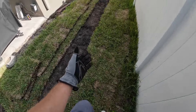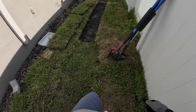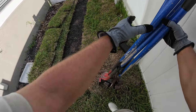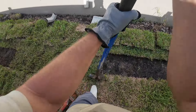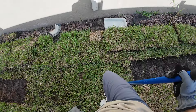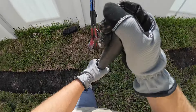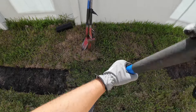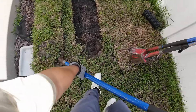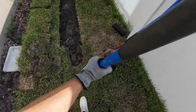Normally we don't get this lucky with newer sod where we can just peel it back. What you're gonna do is take a nice wide shovel — like these blue huskies. The best way to easily pick the sod up: start on one side and just chop down the line. Don't need to go too deep, just a good step. Do a line down, a little bit wider than the width of the pipe you're burying. For us it's a four-inch pipe today. Swap sides and once you go down that line, chop every two or three feet. You get nice clean pieces of sod you can set to the side so you can put them back after — don't have to re-sod your whole yard.